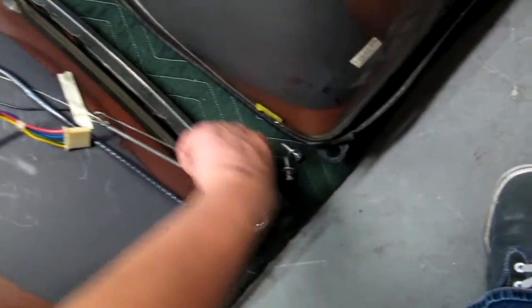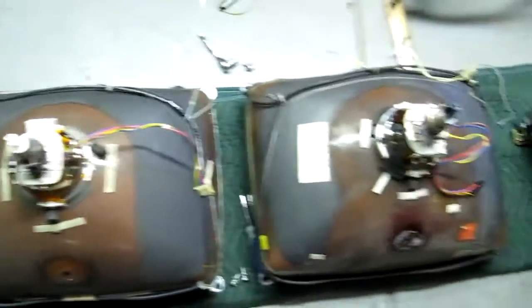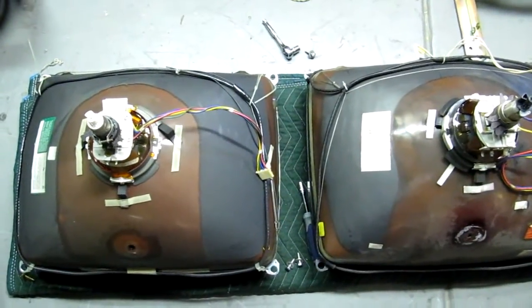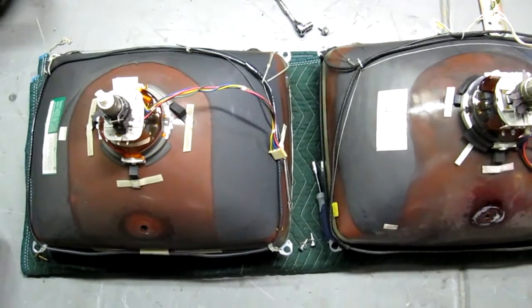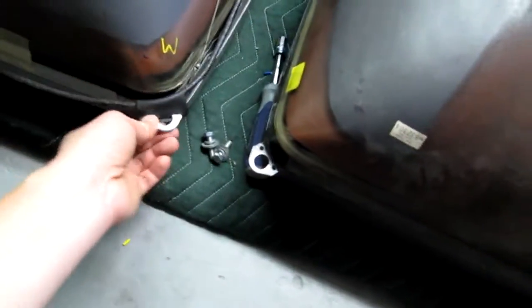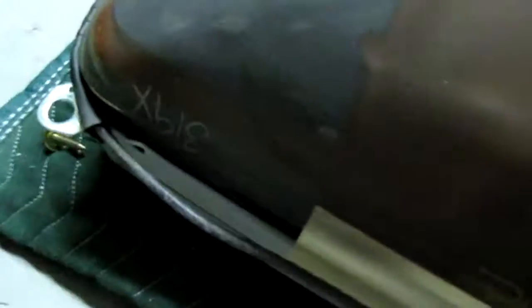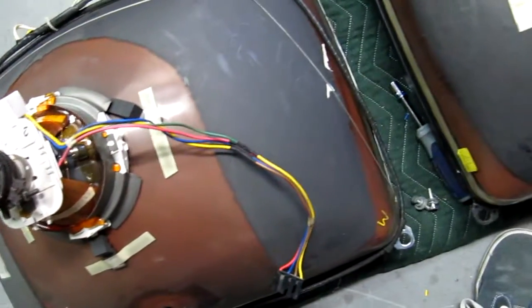You will notice little differences — the TV and arcade have some of these hole-throughs on the mounting strap that goes around the tubes. Sometimes they're a little different like that. I'm jumping forward again since I'm doing this by myself with one hand holding the camera. We've made a bit more progress. We've transplanted the degauss coil. On this one the coil is held by vinyl loops that kind of wrap around the coil and hang on each corner — there's one in each of the four corners. This coil has plenty of slack so it doesn't need to be tied down like the other monitors where they needed a long zip tie.